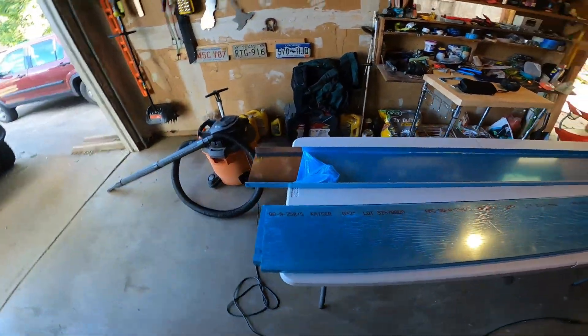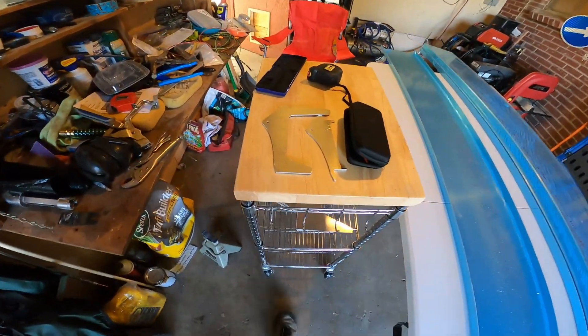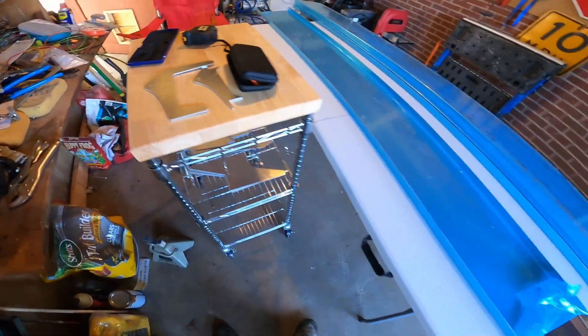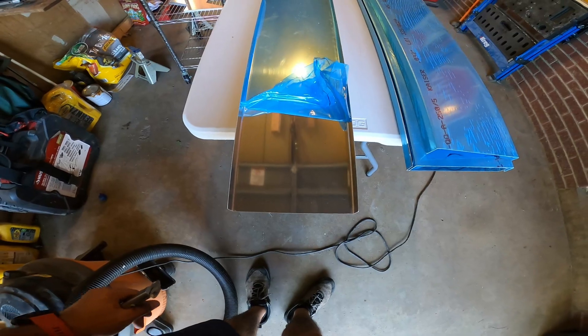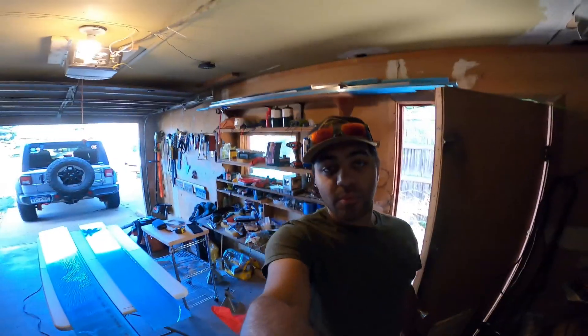Pull a little bit of the plastic back. I'm going to make sure my center points are marked right here on the brackets, which my dad laser cut. Mock them up, use a Sharpie, measure 15 times. We will start drilling the fuselage attachment bolts.